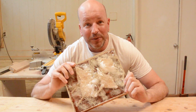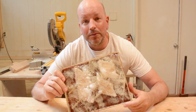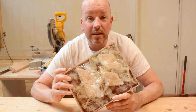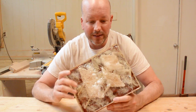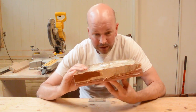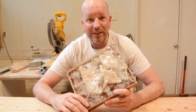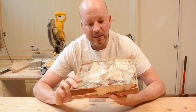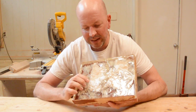As you can see, this was a complete and utter failure. I think this is the first piece I have ever made that I will not be able to recover and repurpose into something else. Something went horribly wrong with the epoxy. I discussed it with the TotalBoat representative and we concluded this was not the right type of epoxy for this type of work. I poured it too thick, and on top of that it was about 90 degrees Fahrenheit in here when I poured it. A combination of factors caused it to generate too much heat and it cured too quickly. It basically boiled and then cracked.